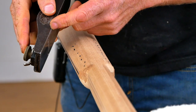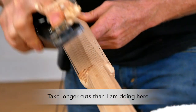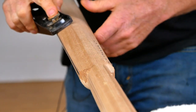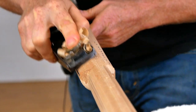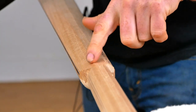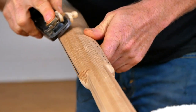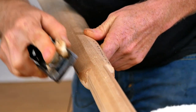Coming in here with my block plane set to about a medium cut, I'm just going to start taking off some pretty big shavings of wood to plane this down so this surface blends into the cut we just made along the loom. Right now I'm just planing a flat facet right here and I'm going to round it over in just a sec. Now I can start working really close to my line — about an eighth of an inch to a sixteenth of an inch away from the line.